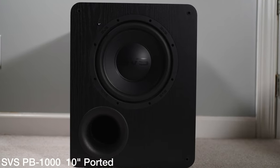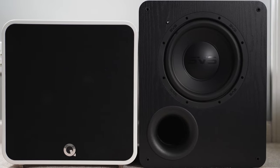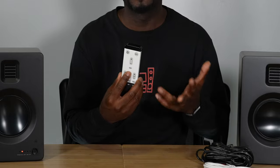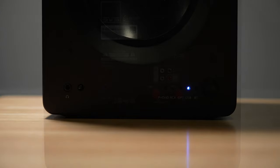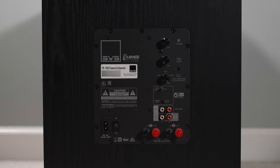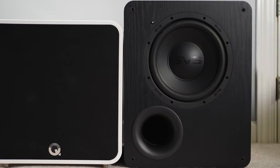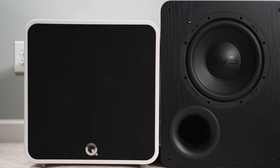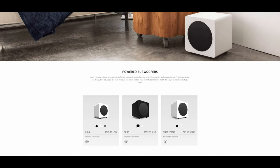Most music and movies are at 40 Hz and above, so these will give you a great experience, but if you want a subwoofer it has that subwoofer out connection. I tried two subwoofers: the SVS PB1000, a 10-inch ported subwoofer, and the Q Acoustics QB12, a 12-inch sealed subwoofer. To activate the crossover at 80 Hz, push and hold the subwoofer button on the remote for about five seconds until the lights flash. From my experience, I prefer a sealed subwoofer with these speakers — it gives depth, detail, and fast transients. Kanto Audio does sell sealed subwoofers to pair with these.